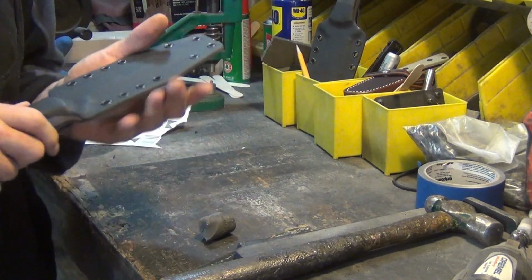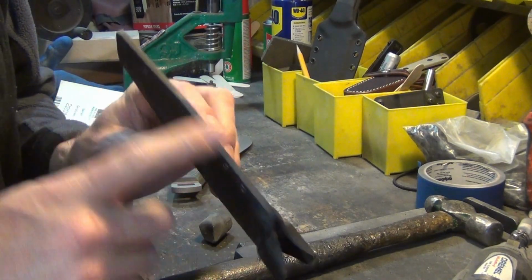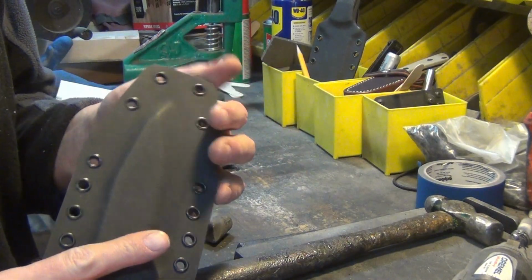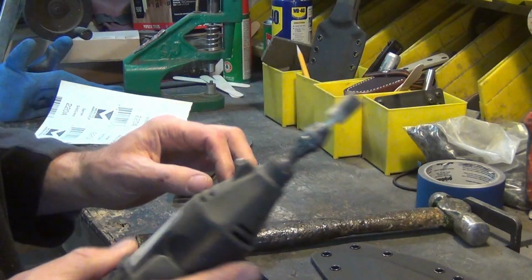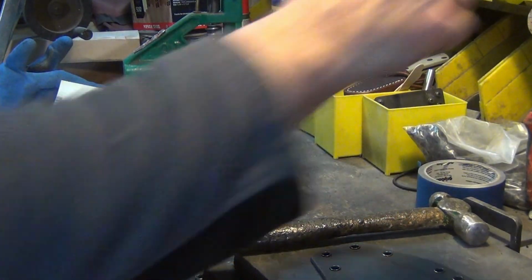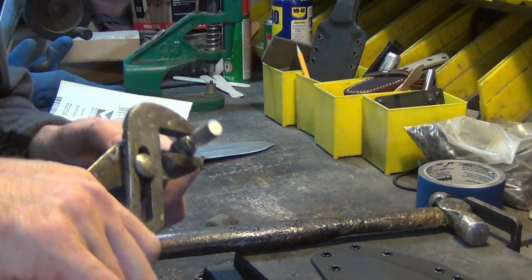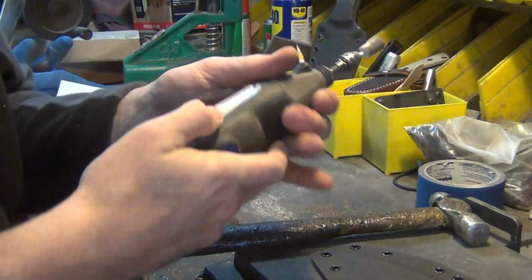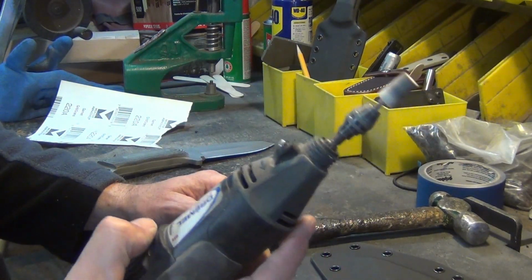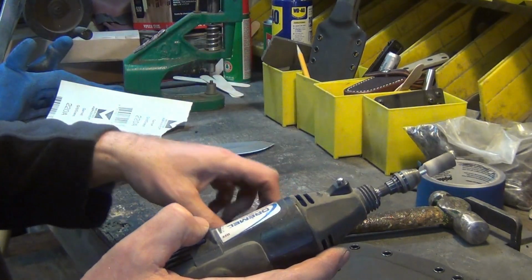So now what we have to do is burnish or shine up the sides. Alright, what I tend to do is I start off with my little Dremel. Again, do not put this thing on full blast. If you put it all the way up, what's going to happen is you're going to wind up burning your plastic. So this happens to have a speed on it, which I like. Nice easy speed. Don't put this sucker on 10. You'll burn a hole right through all the stuff that you just made.